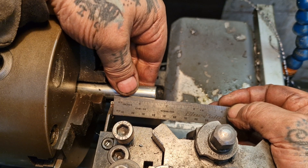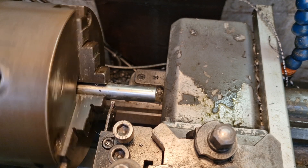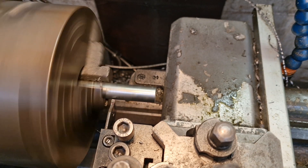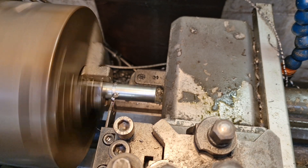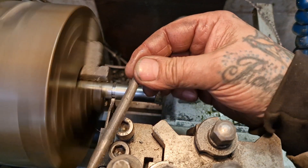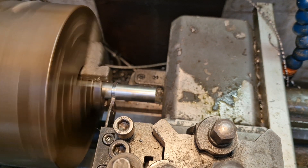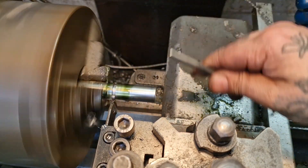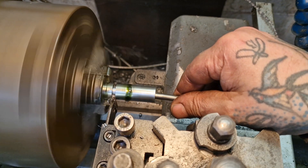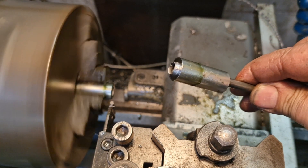Inch and a half in my book, so that's inch and a half at that. Tighten that up, slow the machine down, part it off. We'll get that started, back it off, break that edge with my dinky little file. Put a bit of lube on and go again - and she blows. Come on, boosh! So I'll put that in the other way around and break that burr and clean the end up a little bit.